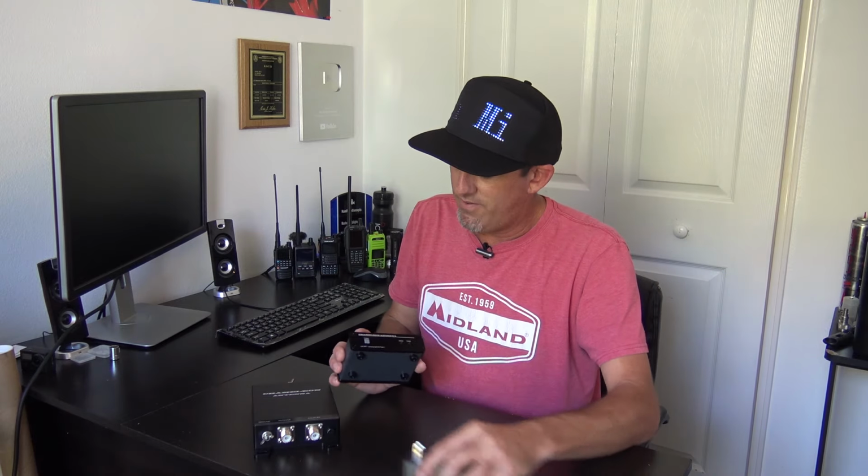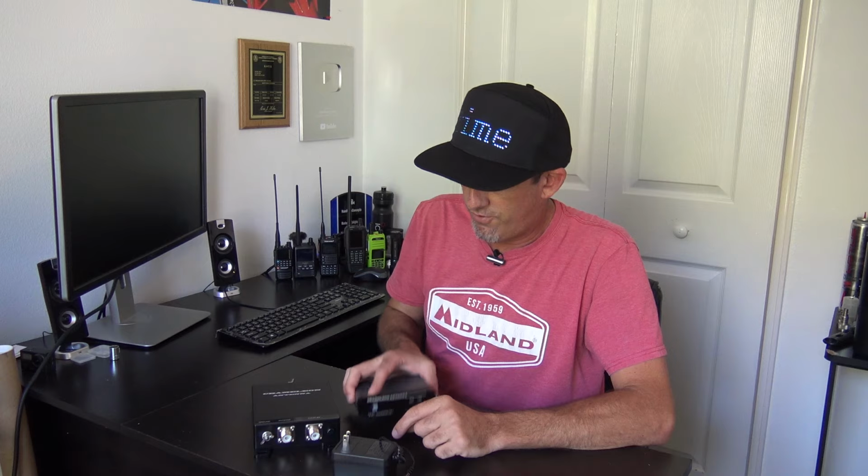Okay, so we're gonna put this on. Like I said, all you need to do is connect power to this, and there's a tuning button here. So what you do is, I'll show you, you key up. You send a solid carrier like RTTY or CW. You key up, you hit the tune button, and it's gonna find a match. It's gonna put it in memory. Once it finds that in the memory, if you ever return to that frequency on that setup, it's gonna right away go right back to that memory of the inductance, the capacitance, the resistance, or whatever it used in this network to make that match, to make your antenna tuned.